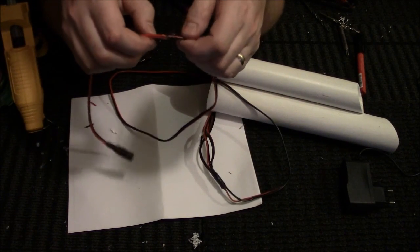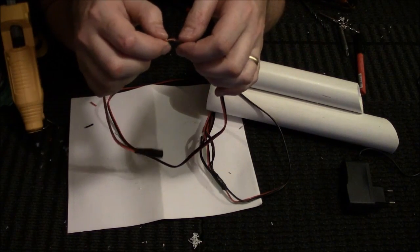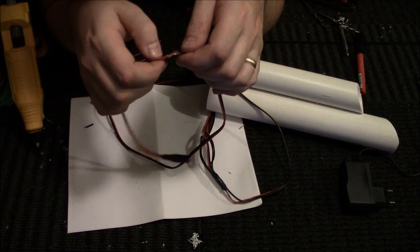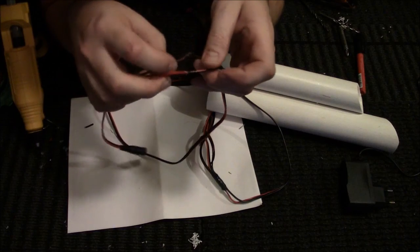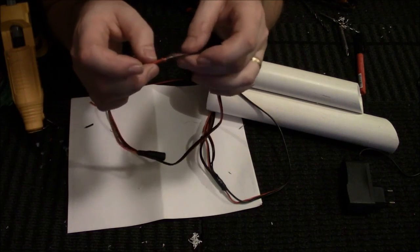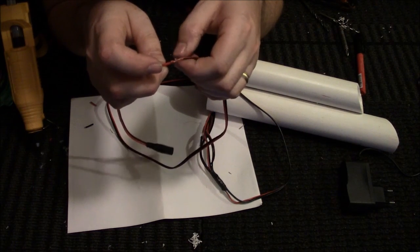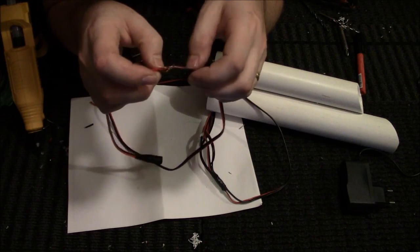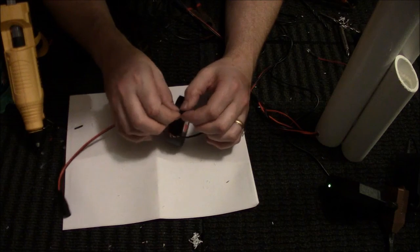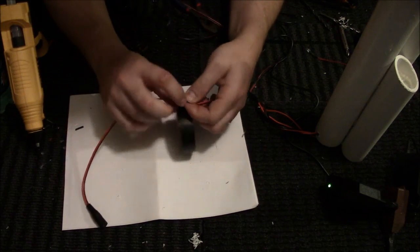So on this one, I would recommend, if you buy this specific type of pigtail, a lot of them are black, and then they come with a red and black wire on the inside. They have black sheeting on the outside, and then the red and the black wires need to be cut as well. For this particular type of pigtail, I would do black red to black and red to red black from there, so that you have your red on there. Your solid red would go to your red black, and your red black of the pigtail would go to the regular black. I will write that in the instructable as well, or in the description.